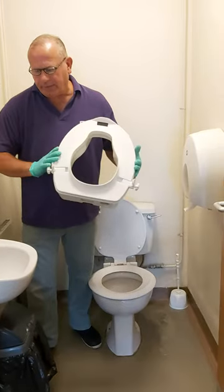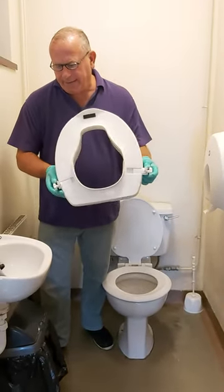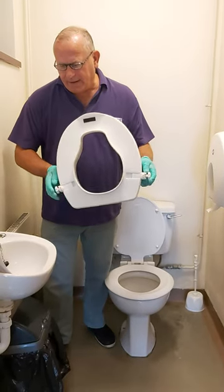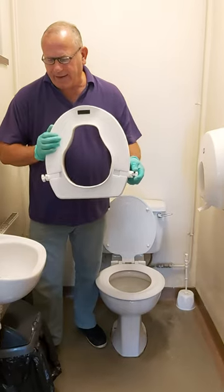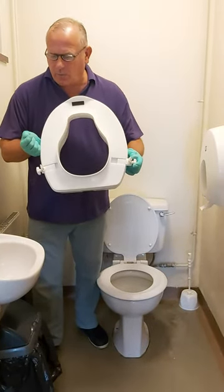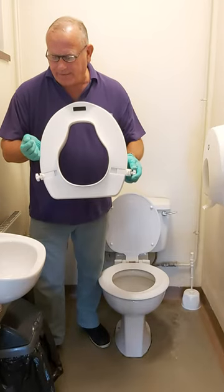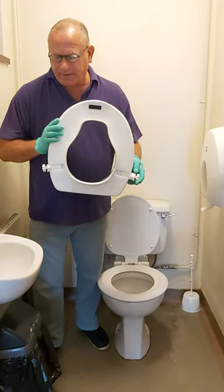It's secured to the top of the toilet seat and has mounted brackets, as you can see here. You have to ensure that the lip is on the front and the outside of the pan. You secure it by tightening the lugs, one going one way and one going the other way — in opposite directions. Once that's done, you test that it's safe and secure.